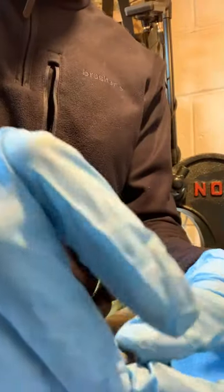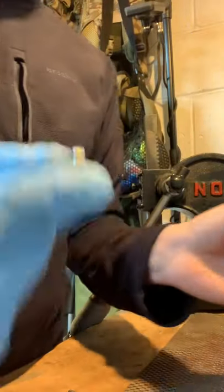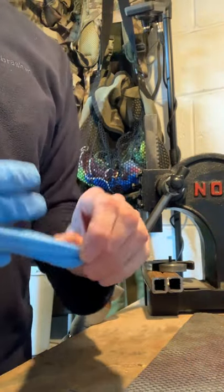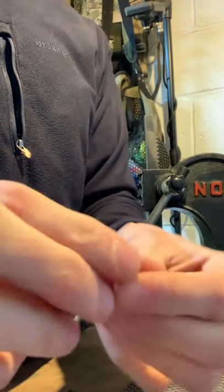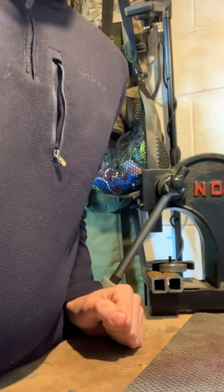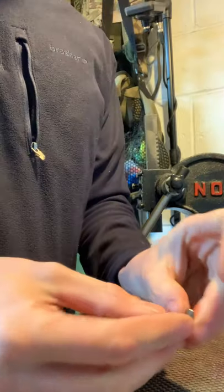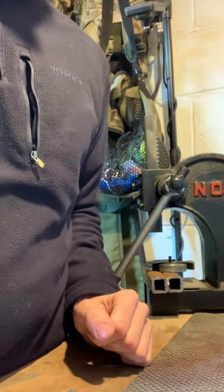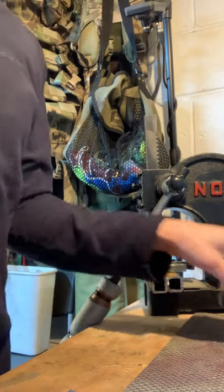It looks like that and then I just use a little machinist hammer and tap it. You're left with a nice dimple nose slug — really nice, these shoot brilliantly. Highly recommend them. I'm shooting them out of an FX Impact power plenum. The dimple ones come out at about 32 grain, which is brilliant. I'm shooting them sub-MOA at 100 yards at 960 feet per second with a superior heavy liner. I've also made these with hollow points — both shallow and deeper — they work out to be about 28-29 grain, still good weight, shooting them over 1000 feet per second, sub-MOA.